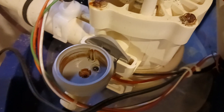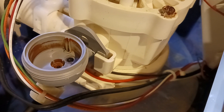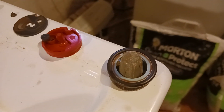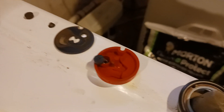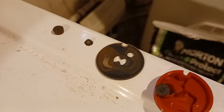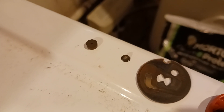This is what the orifice looks like when it's all opened up here — these are the guts of it. There's the main filter with the o-ring, then this kind of plate here with another little valve on it, a rubber gasket, another little mesh screen, and another rubber valve there.